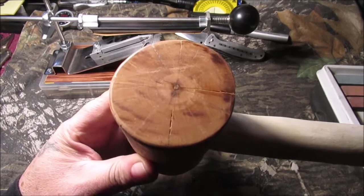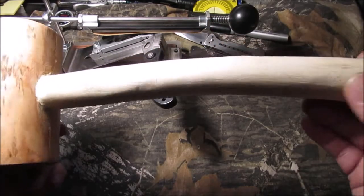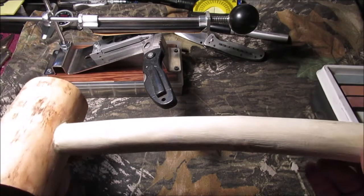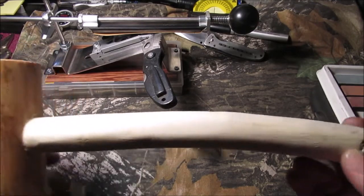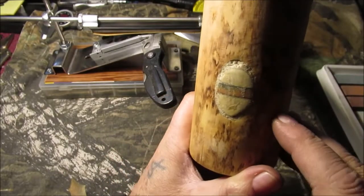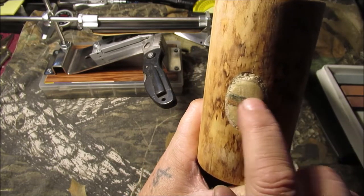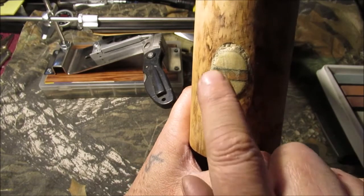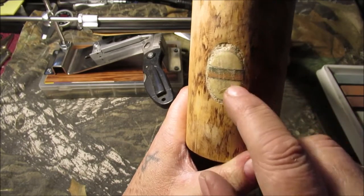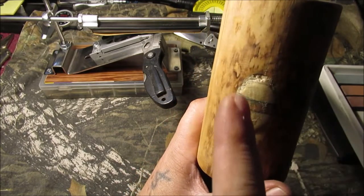I really been enjoying it. I made this and started to make a video on it, but then it started cracking. It's supposed to be silver maple - I'm sure it's just regular maple branch, cut a while back when I was cutting trees around my area for the mulch. It's pretty dry, been close to the stove. That's just the natural curve of the branch. I had a half-inch drill bit, three-eighths, and I chiseled it and made it oval shape. The handle is one of them thick big paint sticks - has a little paint left on it. That's gorilla glue mixed with water - it foams up, it's good stuff. The wedge is oriented so it doesn't split the wood apart.